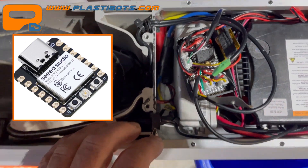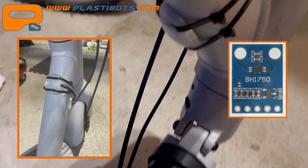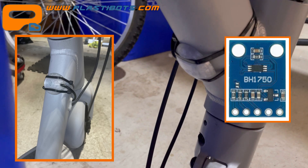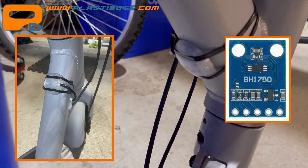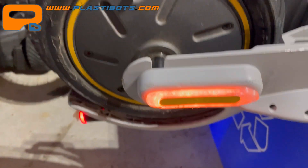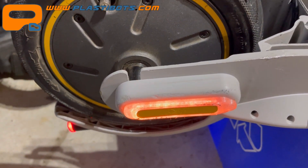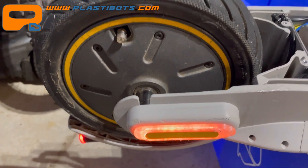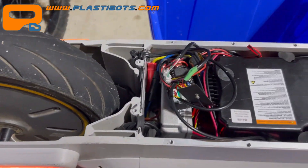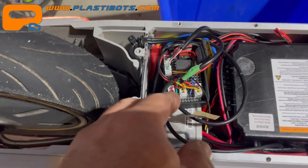The main connector here is for the light sensor right there — 3D printed again, it's inside the unit. It detects light and measures a value in lux, and I use that to determine both how bright the LEDs are and when they ramp up to full brightness from dim as night falls. So I don't have to worry about any kind of switching — they're quite low during the daytime and then during the nighttime they come on bright.